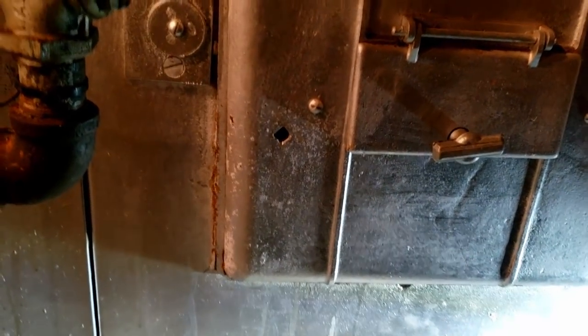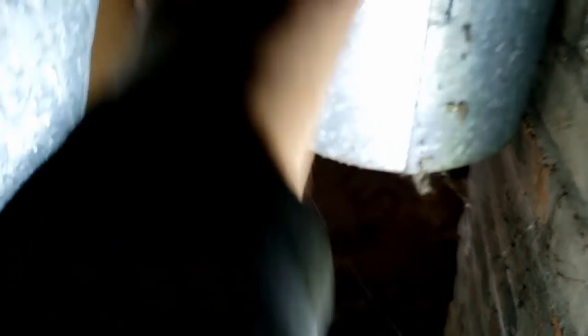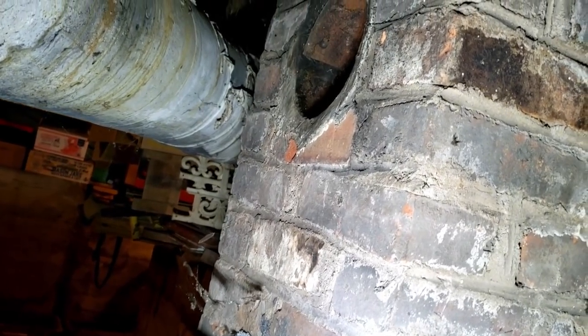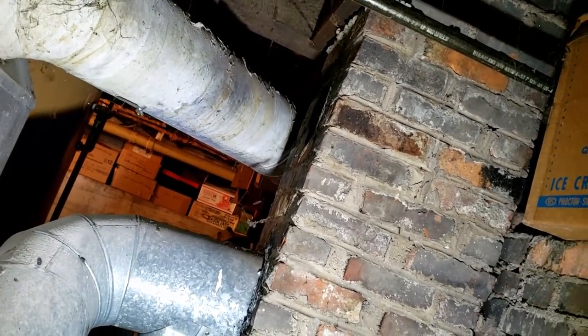Make sure the chimney's clear too. That doesn't help your chimney — you've got an empty spot up here that should be closed off, so I'm gonna have to make something up to seal that. The chimney's got a big old hole there at the top — see that — that reduces your draft, it shouldn't be like that. It's probably from an old water heater or something. I'm going to seal that up with some sheet metal — that's about all I've got on the truck. I'll inspect it and make sure I can see daylight at the top to make sure it's all clear and open.